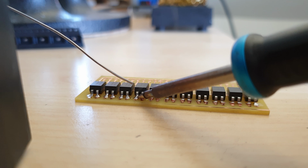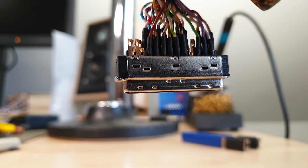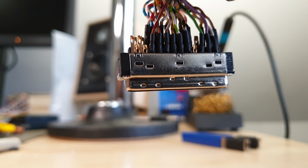I spent an absurd amount of time making the servo drive in and output cables as nice as possible. I went with a shielded cable with 16 twisted pairs, so that nothing can get in the way of absurdly high step frequencies and encoder feedback at maximum resolution.